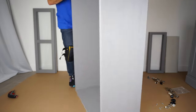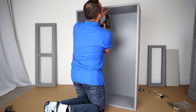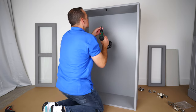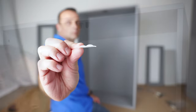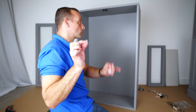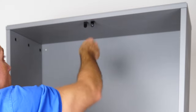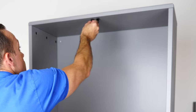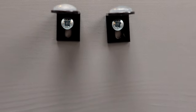Now you can lift it up. We're going to have this L-bracket with two screws and we place them into the top panel — that's the stopper for the doors on the top. Position the screws in exactly the same way on each of them so the door is going to be equal. Now we have those rubber stickers — place them in at the front. That just reduces the sound when the door closes, softening the closing. You see the screws are exactly the same on each of these L-brackets.